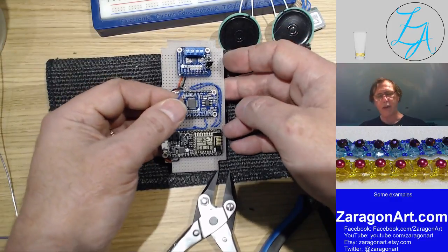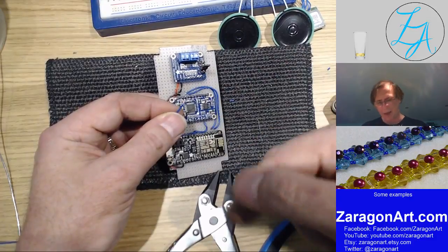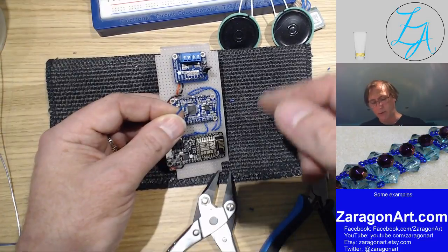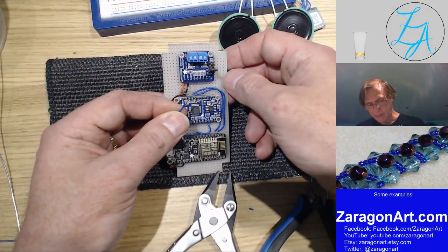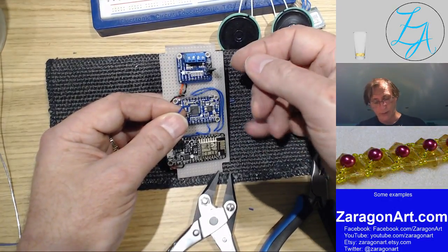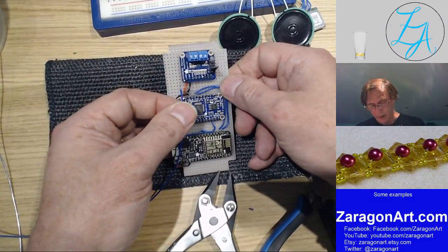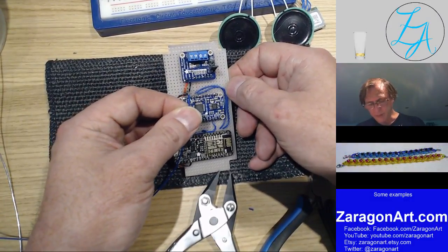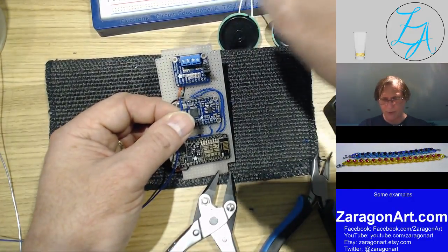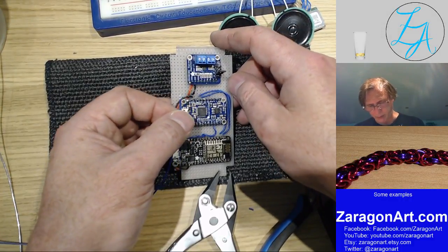So using either a coaxial cable, which has an earth shield around it, or a twisty pair, because of the way this works, would neutralize the interference, and therefore it doesn't come out. But I'm not going to do that. I'm just going to run them side by side. So I may well get noise. But this one that's in front of me is a rat's nest, and that doesn't particularly pick up any noise, so I'm not too worried.